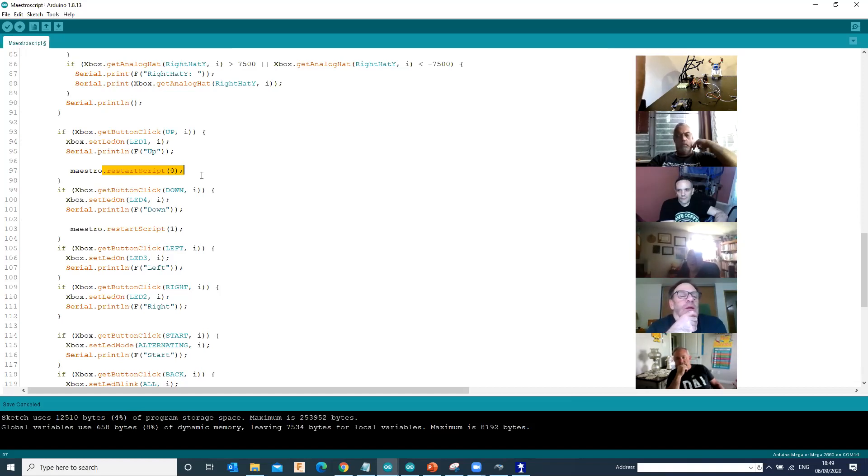The main task of the Arduino should be: what direction do you want me to go? I'll keep moving the motors. What you don't want is for the Arduino to be waving arms while you can't control it for eight seconds - that's where you start to run into people. The beauty of the Maestro is it's designed to do acceleration and deceleration to slow servos down. Like the little periscope on Chopper - it comes up slowly, comes to a halt, turns around, turns the lights on. All of that would kill an Arduino because it would have to send every single micro servo position at the right time. Whereas the Maestro does all that; the Arduino just says 'run that script for me'.